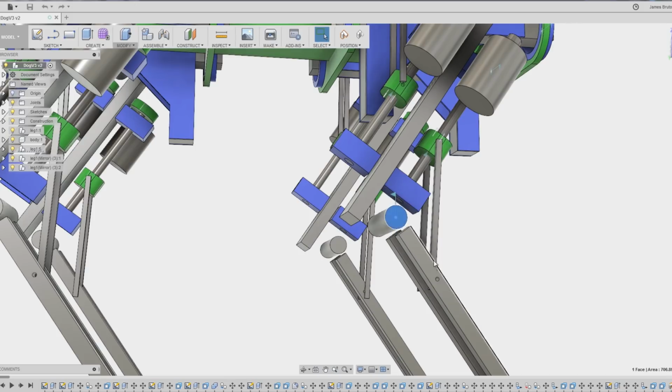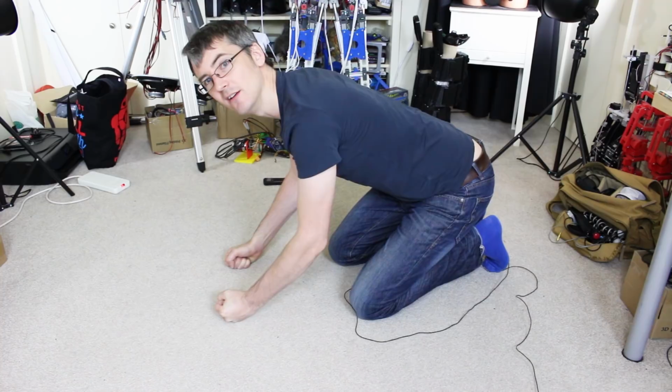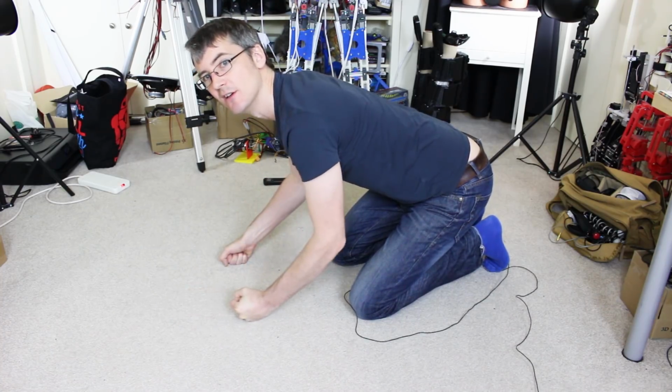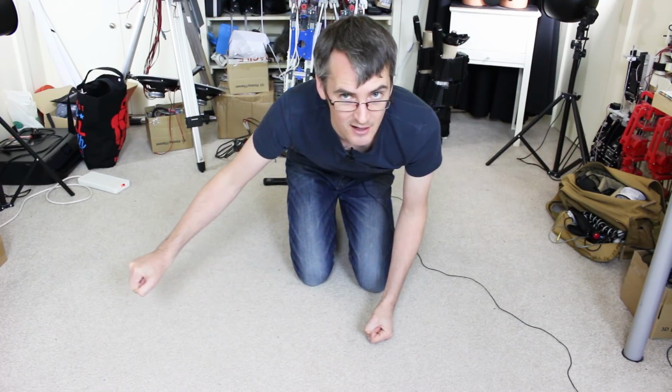And that's why I've designed those robot leg actuators and the push rods to be in perfect triangles. So this is easier to explain if I pretend to be a dog. Basically, if I want to move my front leg forward in a straight line, obviously my arm has to extend and this elbow has to extend, and it bends back again when I put it back in place there. So it would extend again that way. Similarly, if I wanted to move it in a straight line sideways, my arm or leg would have to get longer there to stay in a straight line. And if I move it up in a straight line, then not so much.